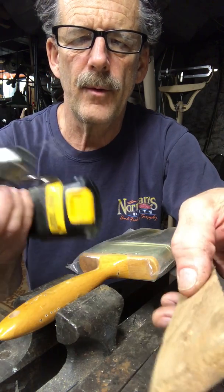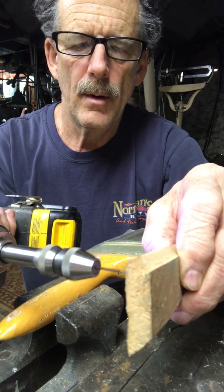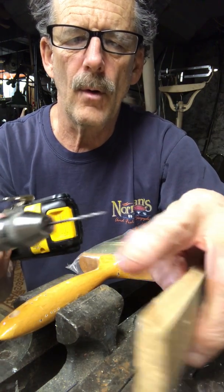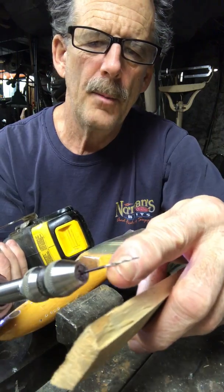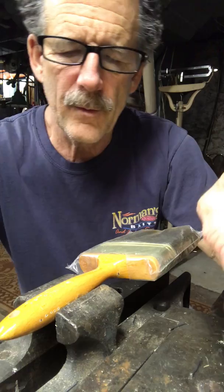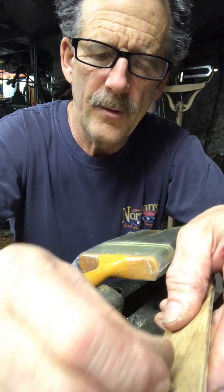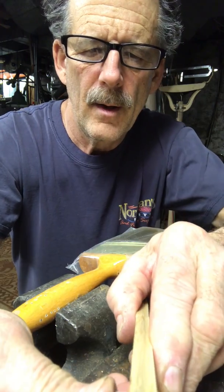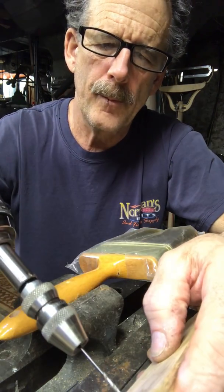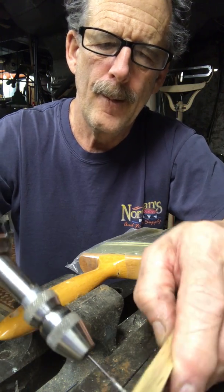What you're going to do is take your drill and drill right through your lattice, but don't go all the way down. You want to stop pretty much where the end of the flutes of the drill are. You can take your brad and try to see how it fits. That's a little tight, so you can go a little more. You'll get a feel for how deep you want to go with your drill.